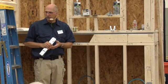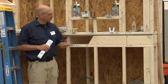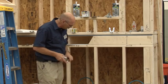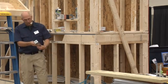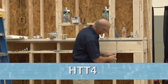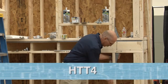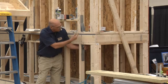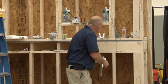A lot of architects just copy the same thing over and over — it's not always the best design for what you're building. Personally, I'll get in touch with my local Simpson rep and let him look at the boiler plate; he'll probably suggest some alternatives. Here's the HTT-4: I've got one on the top and one on the bottom, and a threaded rod goes completely through. I've got my strap coming underneath the mud sill plate with a connection all the way down to the foundation. The HTT-4 pulls together the first and second floors — that's one way to span that distance.